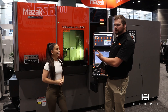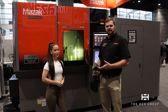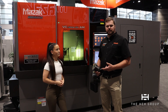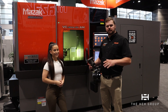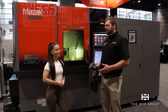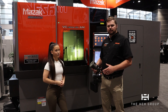This is our VC500A 5X hot wire laser deposition hybrid machine. It is both a metal 3D printer and a fully capable five-axis machine tool. We have a 12K spindle, optional 20K, 30 tool changer, optional 60 tool, 500 millimeter working diameter by 300 millimeter height — a very capable, very optionable CNC machine tool. In addition to that, I've got the hot wire laser hybrid capability, so I can build and subtract in the same envelope.